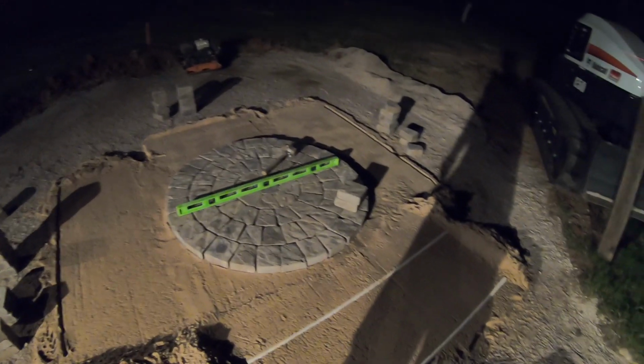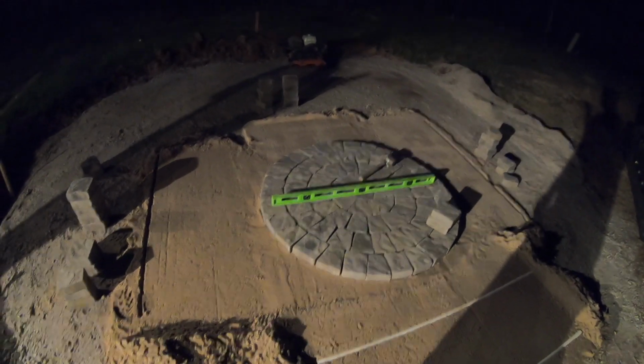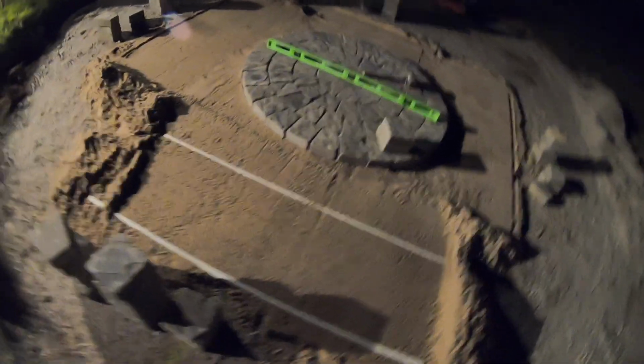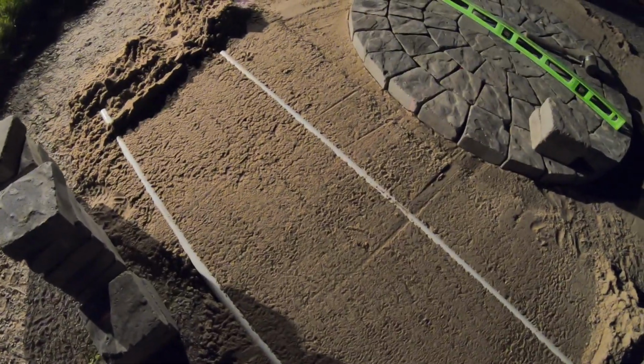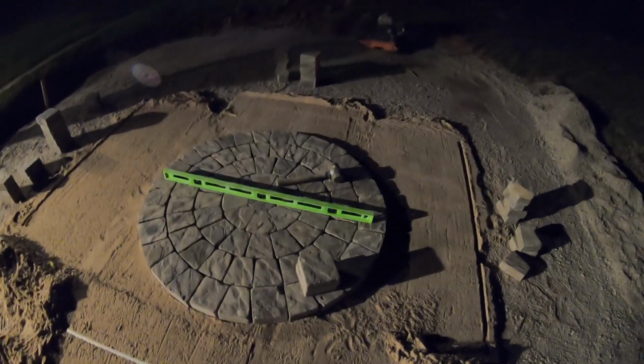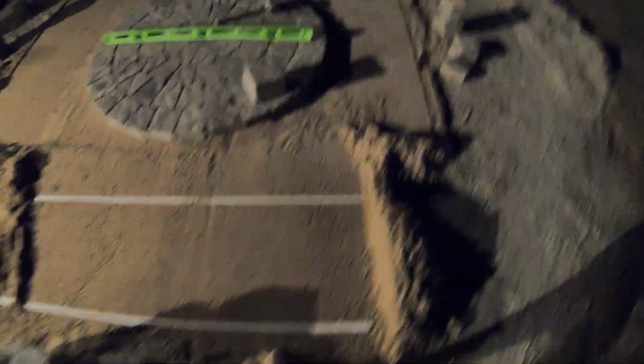Toby's in for 11? Alright, we started laying some pavers because it finally cooled down in Texas. It's not 100 damn degrees. So we started screeding the sand, and we're using cement sand. So we got like 1, 2, 3, 4 courses done. And then to screed, we're using 3/4 inch PVC pipe.